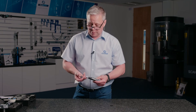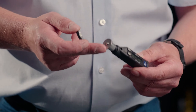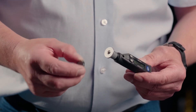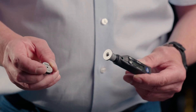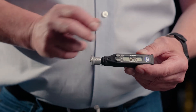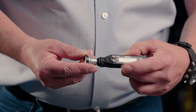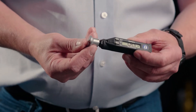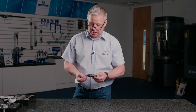Exactly the same principle — I've got the tapered plunger in 90, 100 and 110 degree standard tapers, and I've got the conical setting master. On the setting master I've got the size engraved, backed up by a calibration certificate again, and I've simply already preset that into the menu. I'm going to hold that in position and then hit the set button and we're set using that gauge. And now I can measure countersinks anywhere in that gauge's particular measuring range.